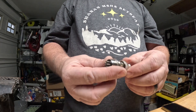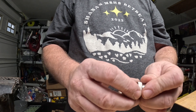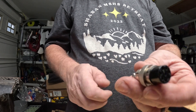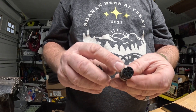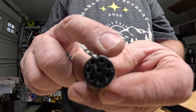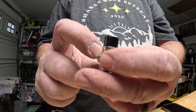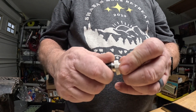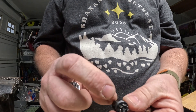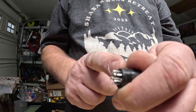When you get this from Amazon, it looks like you got the wrong thing, but if you pull it apart, here's your female connector right here — this is what you need to plug into the generator. If you look on the very end, it tells you pin one, pin two, pin three, working around so you know exactly which pin you're dealing with. On the other end is where you solder your wires in.